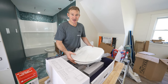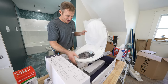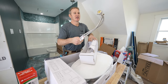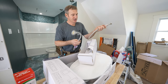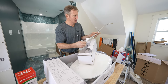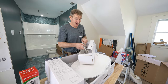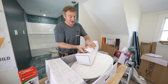If you're buying a new toilet to go with this, I would definitely recommend an elongated toilet — it's just going to look better and sit more comfortably. This is the most important part of the whole system: having an electrical outlet that you can plug this into. You're not going to have to run out and get separate supply lines. One attaches to the T and then one attaches to the actual bidet. This is a really long one — 20 inches. I might actually reduce the size of this because I don't need a 20-inch line with where my existing pipe is. Either way, you have both of them so you'll be able to connect everything.